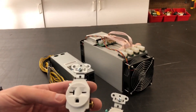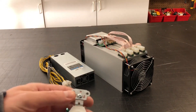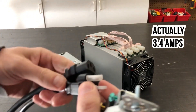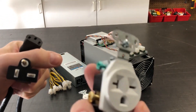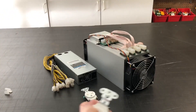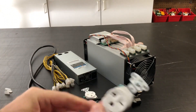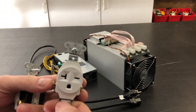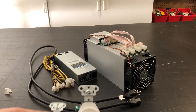The miners themselves do not use that many amps — this will probably use six, maybe seven amps. You're going to need a plug such as this. This fits in the 20 amp. You could use a 15 amp plug also. But if you're going to install these, I would put the 20 amp, just in case you need to use something that needs more power in the future.